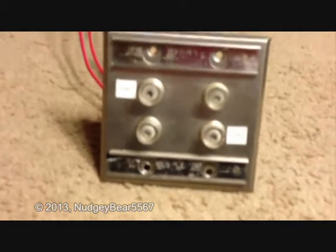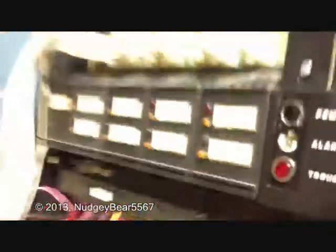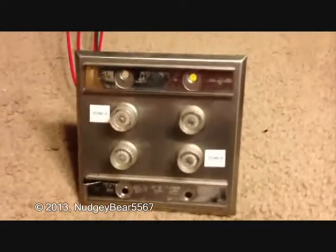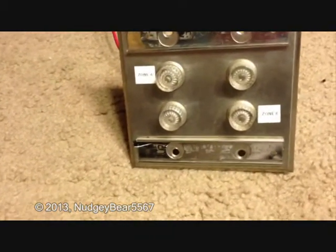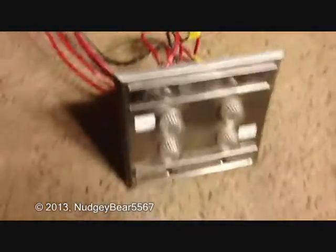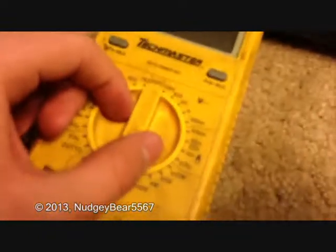The way they would do fire drills would be — obviously not by a drill switch, because there is no drill switch in here. You can see there's like nothing there. Well, this might work, but I would probably still call the fire department. So the way it would work would be: the person who activates the fire alarm would have to call the fire department, and then they would take the panel offline, and then the fire station would put the panel into alarm, which is weird.